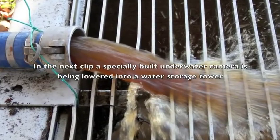The diver is completely sealed in his own environment. He's wearing a dry suit that's purchased for and only used in potable water, as is all of our gear. And then we wash everything down with the chlorine solution to meet American Water Works Association requirements.